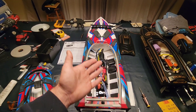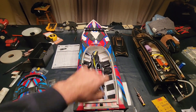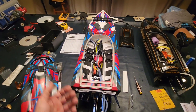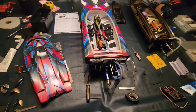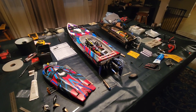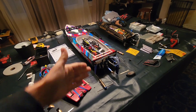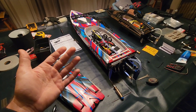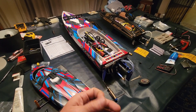Let me know if I should try to put more weight inside the boat, or do some sort of more permanent wing on the front. Should I move it? Give me any insight — anything you've done with your Spartan to help control chine walk. I want to try to at least break the 60 mile an hour barrier. I think that's totally possible, maybe not longevity-wise or race-wise.